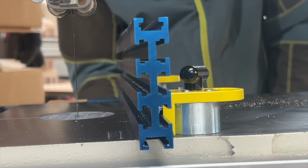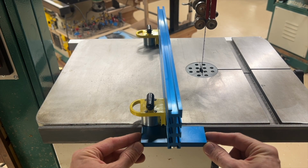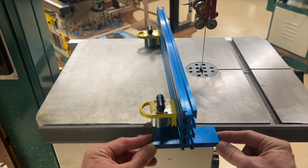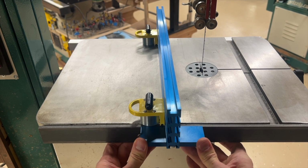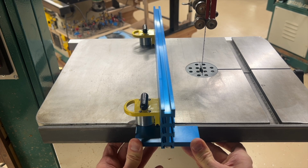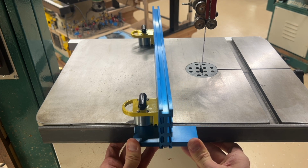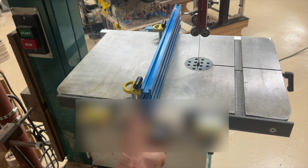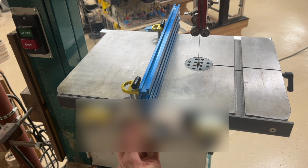This is easier to understand as you see me lightly push left and right on the fence, and you can see it dragging in the back, primarily because of the gasket that I put in the magnets that is doing exactly what I wanted it to do originally, which is hold the fence to the table. To get the whole fence to move evenly front to back, I need to push forward on the drift adjust block as I move it side to side, and my cool looking little micro adjust jig didn't do that at all.